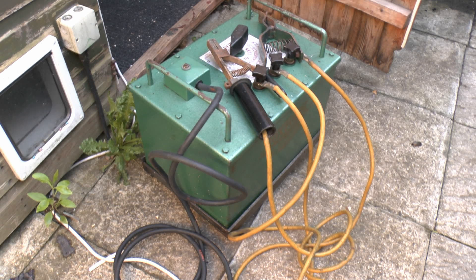So it's quite a straightforward device — essentially just a transformer in a big box of oil. I won't be opening it because although you can undo the bolts on the top, the transformer and the whole of the workings inside is actually attached to the lid, so it would need some kind of hoist or crane to lift it. And once lifted you can't put it down anywhere without damaging components, and of course it is immersed in oil so you'd have oil dripping down making a mess. But essentially it's just a transformer and a variable tapped inductor inside — so not a huge amount to see.